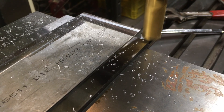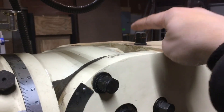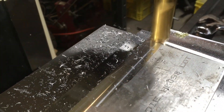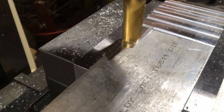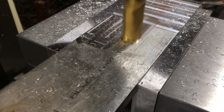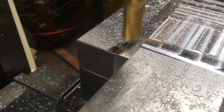Next it's time to apply the same technique to the Y-axis alignment. Just like before: loosen the jam bolts, adjust the angle, and check the results. A vertical mill that is well set right on square will leave a shadow of a previous cut when passes are overlapped in any direction.